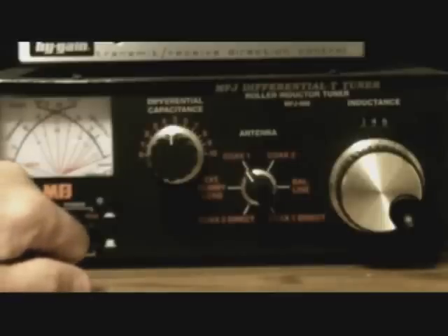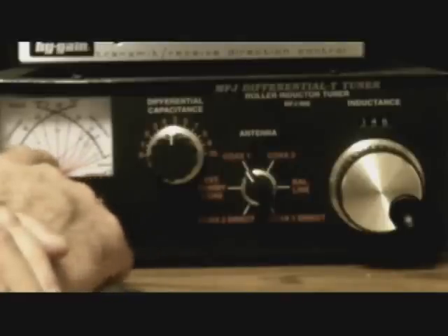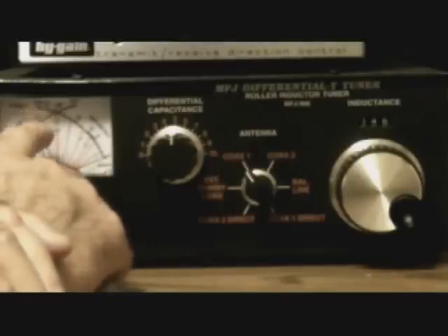Let's see what we are right now — keep your eye on the meter. I'm pushing to talk... Wow, we got a mismatch! I've got the radio on 20 meters and the antenna tuner is tuned for 40 meters, so it looks like we've got about three to one SWR. It's where the two arrows cross one another on the meter, and I'm reading about three to one right now.